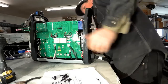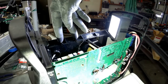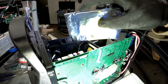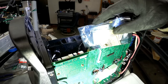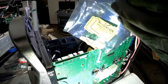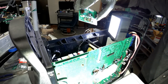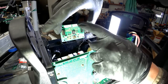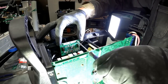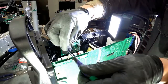Seeing what's what — that big board they call the DSP board. Along the middle there's a plastic piece with two holes in it; that's what we're going to screw it to. It's electrostatic, so you're supposed to ground it out, hold it to the chassis for a few seconds to discharge any static electricity, and just be careful — these things are definitely fragile. I don't have a lot of experience with electronics, so I was just being as careful as I could.